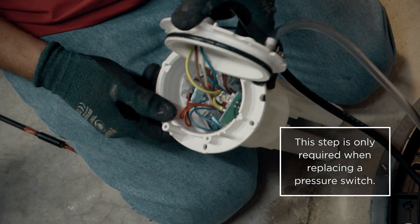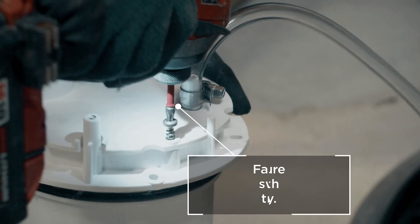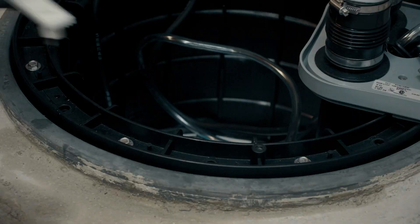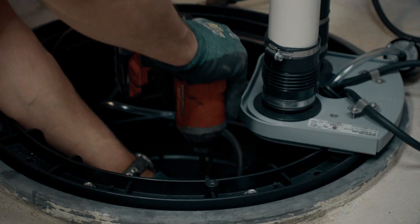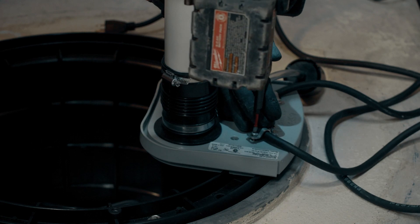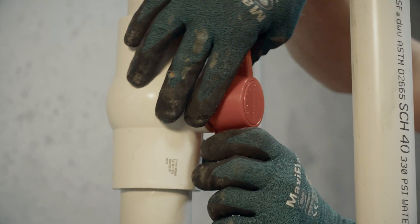Pull this off and you can get to your sensors from under here. After you fix whatever sensor you need to fix, put the cover back on, put your screws back in, put your electrical cover back on, tighten the band down, reinstall it, put your handle back in, and reinstall your outer screws. Tighten down this cable to leave it in the pit for future service, then pull your clear tube back out, plug it back into the unit, put the alarm back in, open up the valve and test.